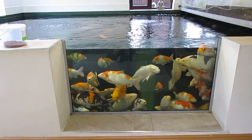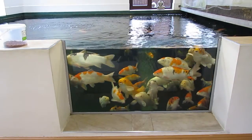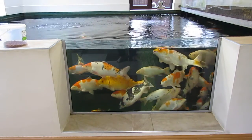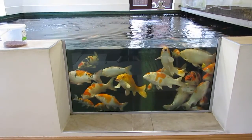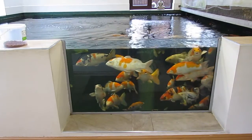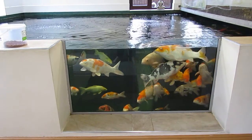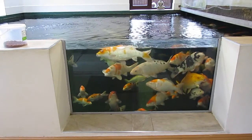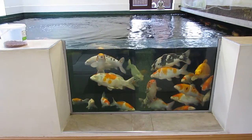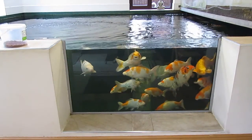When you're looking for air source heat pumps, some, like swimming pool ones, do not work below 4 degrees, so you really need to be careful which ones you're buying. They don't work below those temperatures because it's too cold for them, and they're not very efficient. I've never seen mine turn off. I don't know what it does if it does, but it's not such a problem when you're just heating an air space that's well insulated.